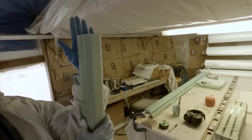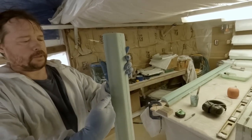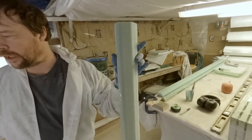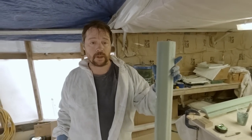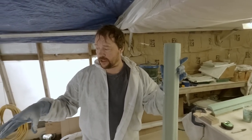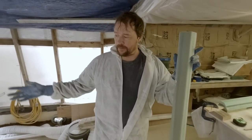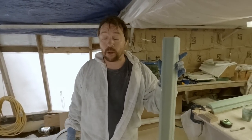If this were the bulkhead, this will be laminated to the bulkhead. There'll be two of them right here, which forms a channel that a bin board can go in. For those of you who don't know, bin boards are basically boards that separate the fish hold into compartments. It allows you to ice fish into them and contain ice down the center that you can draw out of. It also prevents your load from shifting, which is the most important part.